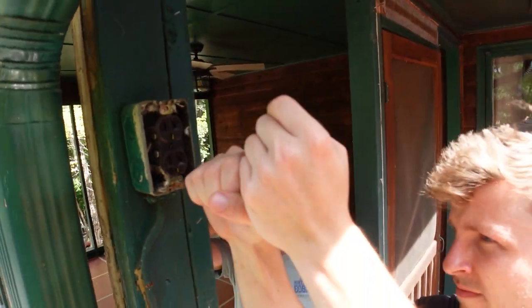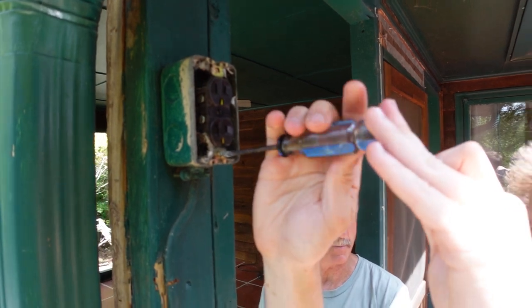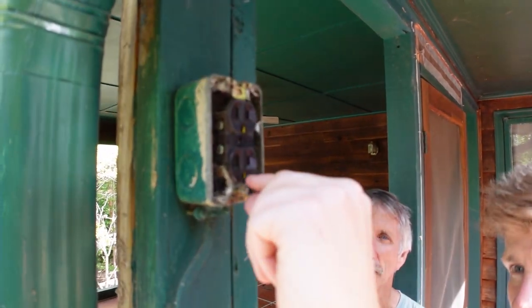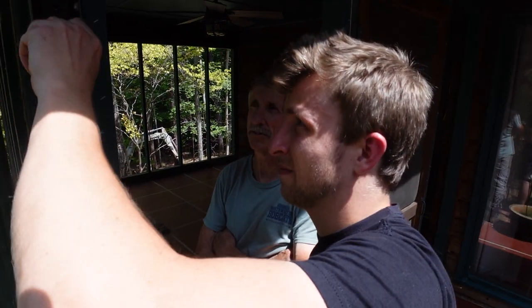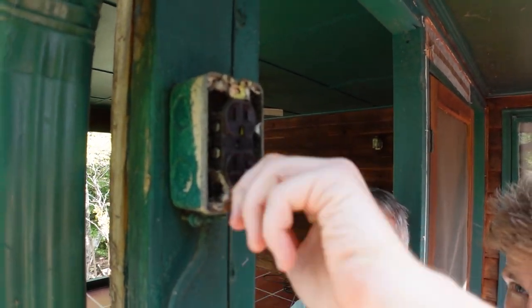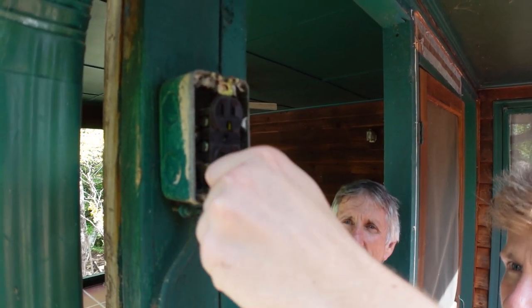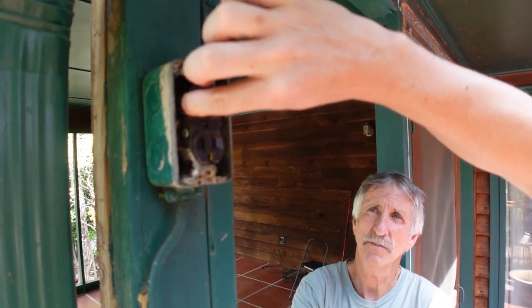You always look and ask: do I want to save that? Probably not — it's been outside for 20 years or more. It's probably not worth saving. An outlet like that is about 89 cents, so it's really not worth keeping. Now pull the outlet out — and watch for spiders and stuff when you do.